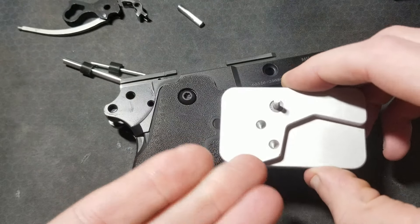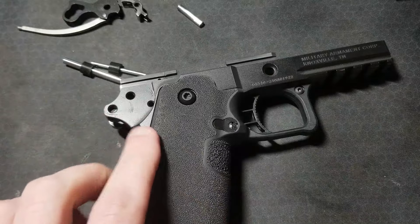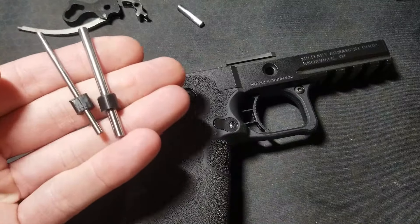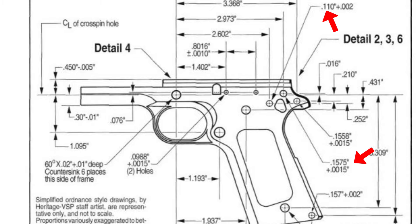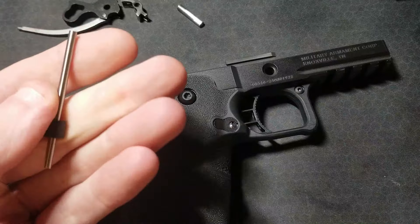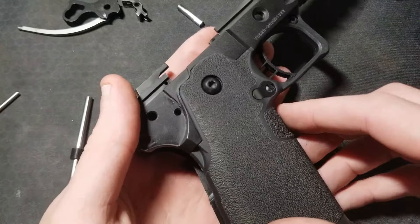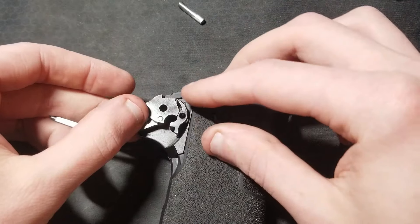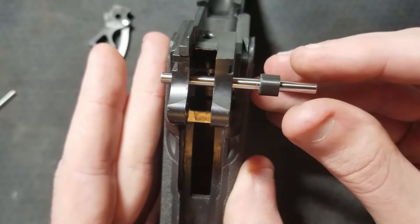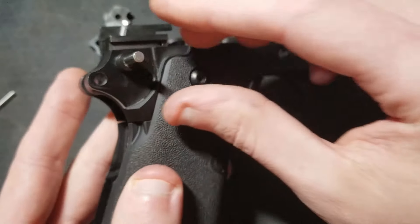Of course, the relationship I see in my jig is not going to be the same once the sear and hammer are in the frame of the pistol — the position and parallelism of the sear and hammer pin holes will vary from frame to frame. I got some gauge pins; I had to slightly undersize them from the spec called out in the ordnance drawing to account for varying hole sizes and different coating methods of frames. The sear pin is 109 thousandths and the hammer pin is 155 thousandths. On a standard single-stack 1911, you can pop the right side grip panel off, lay the hammer and sear right on the frame, and even use the hammer and sear pin from the pistol. I like the idea of longer pins contacting the holes on both sides of the frame for a tighter fit and a better idea of parallelism.